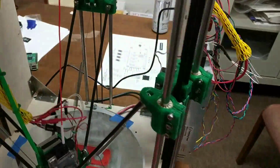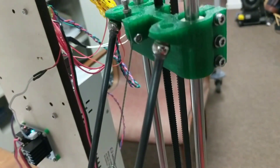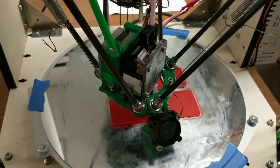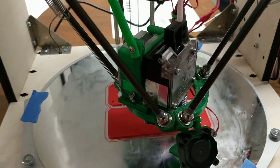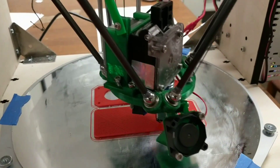The moving carriages have magnetic ball joints with carbon fiber rods, approximately 250 millimeters — they're all the same length. I think these are 254 millimeters; I find a little bit longer than 250 works better. You can see the magnets on the circular effector there.